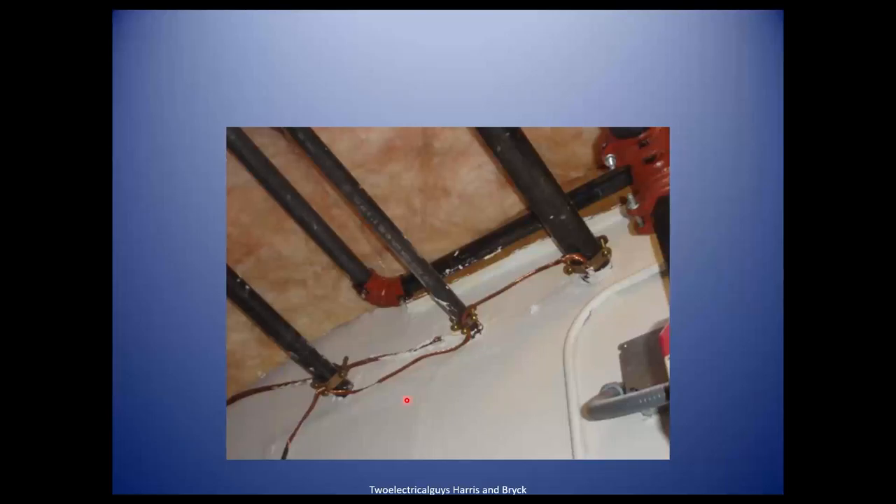Why do I have this metal pipe — is it bonded or grounded? Those are bonded. You're bonding all the pipes together. In fact, you have that sprinkler line above — that should be bonded also. These two-hole straps are okay for free air, but they wouldn't be able to bury those in concrete — they're not approved for concrete at all.